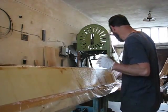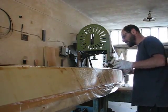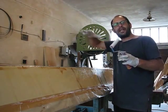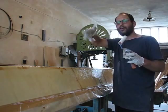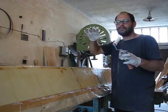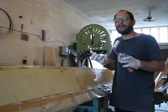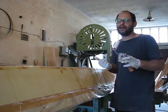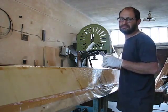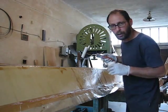Basically, what usually happens is that the wood sucks up the epoxy, and your glass just stays lying on the top, and you see all the squares and all the stuff. And if you sand that, you just cut it away and you've done actually nothing. So basically you have to give back what's gone down into the wood itself, and that's the whole point of the exercise.